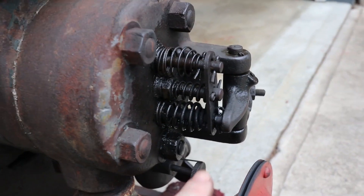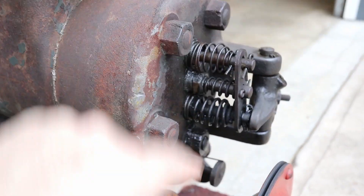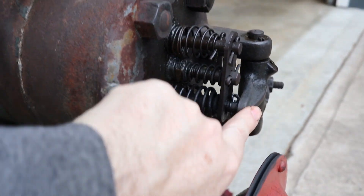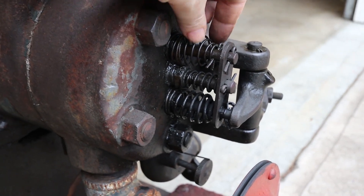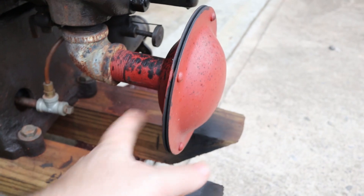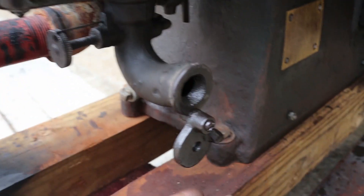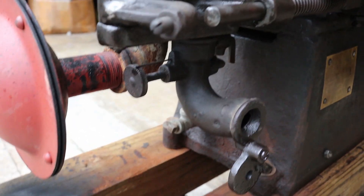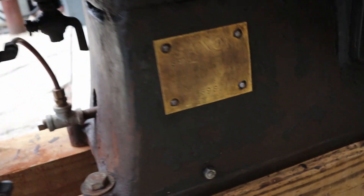The valves: the bottom valve is the exhaust valve, which is operated by the rocker arm for the push rod. The top one is the intake valve, which has a pretty light spring. This spring here is actually kind of a lockout — when the exhaust valve is pushed open, this little seesaw bar seesaws and kind of helps hold the intake valve closed, so the intake valve can't be sucked open while the exhaust valve is open. You've got the little muffler, the little pancake muffler. And you've got the choke — you just move this little flap in front of the carburetor, and that's the choke for starting. It's technically not even called a carburetor — it's called a mixer, a fuel mixer, because that's all it does: it mixes fuel and air.